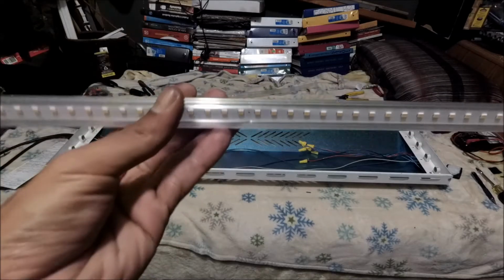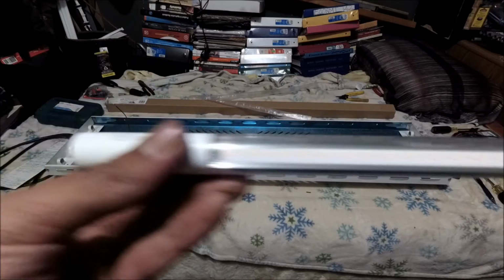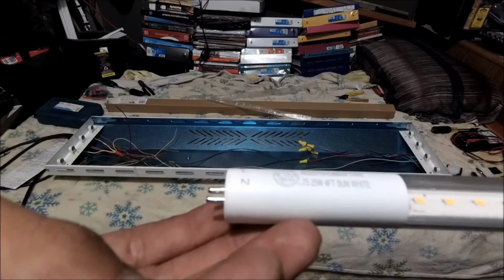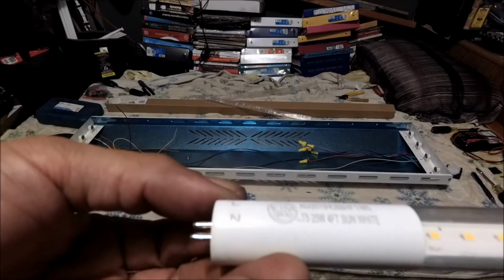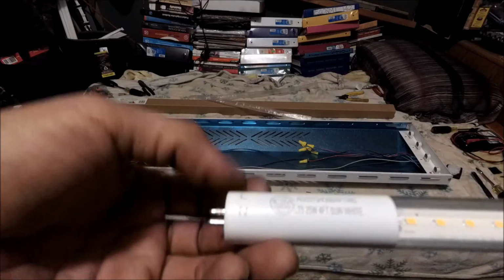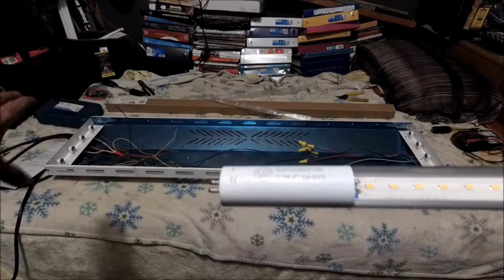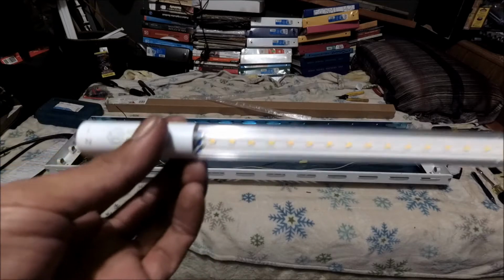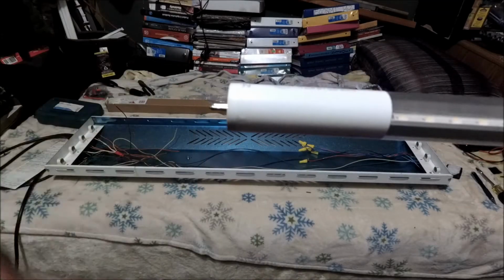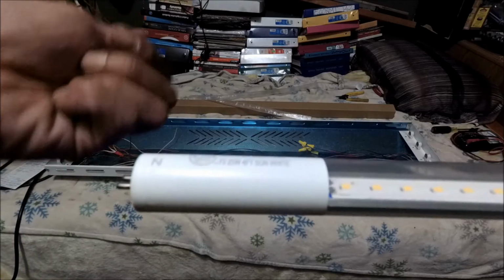They have to be facing up. So obviously you're going to have to turn clockwise, and then this way the neutral is now on my right hand side, or in the bottom, and my hot, my live or line, is on top. It's on my left hand side if you look at it from the light fixture. Okay, so now let me show you down there what I mean. So look, this is the way they go in, and I'm going to turn them this way. So that's why I need my neutrals to be down, to my right, and then I need my hots to be up, to my left.